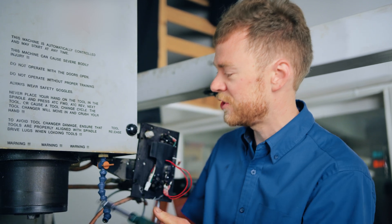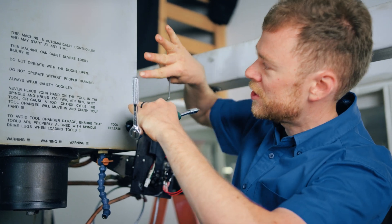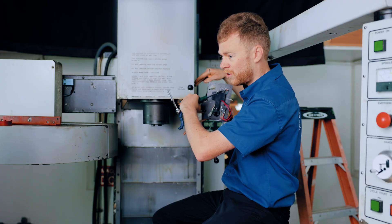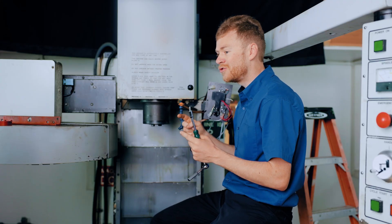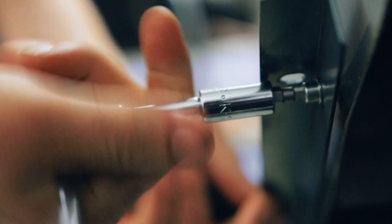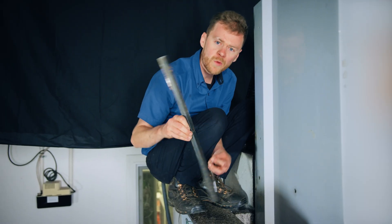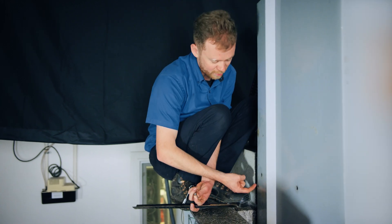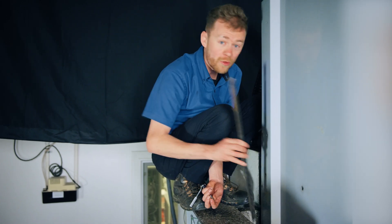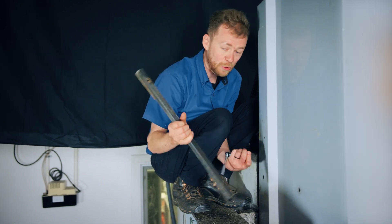We have to watch out for this switch, and the sheet metal is here. We're going to have to jog the head all the way up, get it at just the right position, and wiggle it out without ripping the back of the switch off and unplugging the switch around the corner. There are two bolts on the right-angle metal in the back that are below the truck. I have to pull those first or the head cover won't tilt forward. If you don't pull the lower one out when you try to pull the head cover, it will catch on the Z truck. It's easier to pull the bracket off, then put it back on without the bracket in the way.